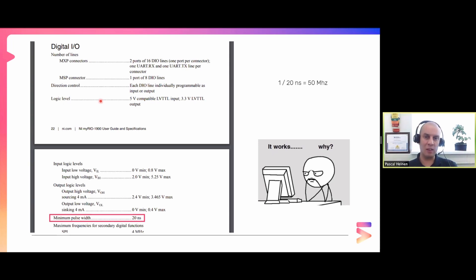The logic level of the digital outputs is 3.3 volts, but if you look at the VGA signal output level it's from zero to 0.7 volts - meaning I'm way over the maximum voltage theoretically needed. But this is also well protected by the electronics in the monitor, so I had no problems. This also means I can only make eight colors: red can only be zero or one, the same for green and blue, and you can mix them - so in total I can make eight colors.